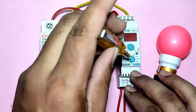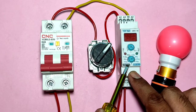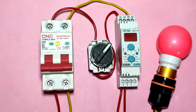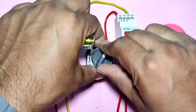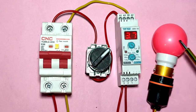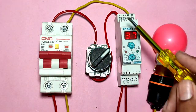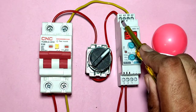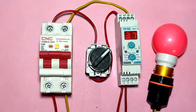We will use the timer as an on-delay timer, so select the knob on the on-delay timer range — a 14-second range is set. Now the input power supply is on. When the selector is on, the timer input power supply comes in, but the timer does not start. To start this timer, we need to trigger it.